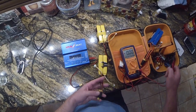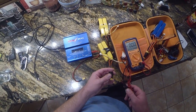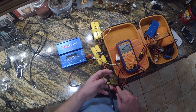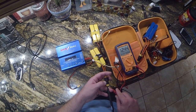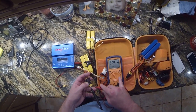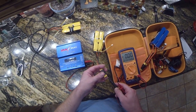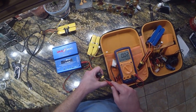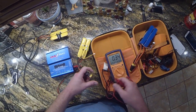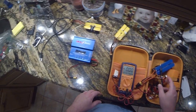The first thing I'm going to do is show you the voltages on two separate batteries — one charged after calibration and one charged before calibration. This one is 12.44 volts, which was charged before calibration, and this is a very accurate meter. This one was charged after calibration, and it charged to 12.59 — much closer to 12.6. I probably could have got it to land right on 12.6.